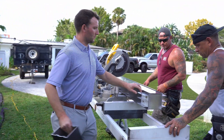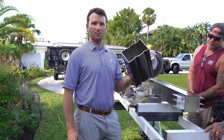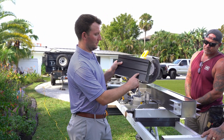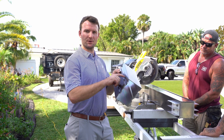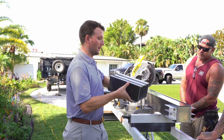Now that we have both internal clips for the left post installed on the sawhorse, we're going to install the beam ends on the ground. Keep in mind when laying out these beam ends, the longer part is always on the bottom. For this structure it doesn't really matter, but when lining up trusses to fit inside these grooves it's extremely important that those are aligned correctly — always remember, bigger side on the bottom.